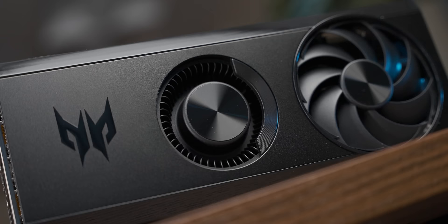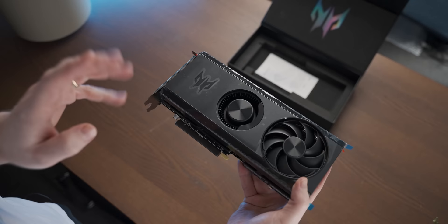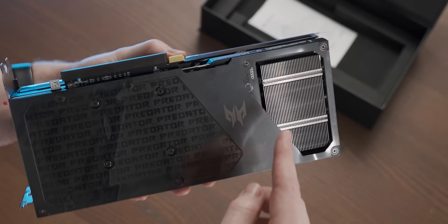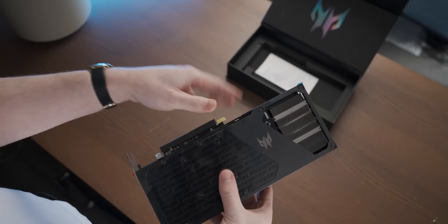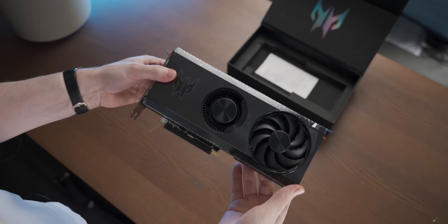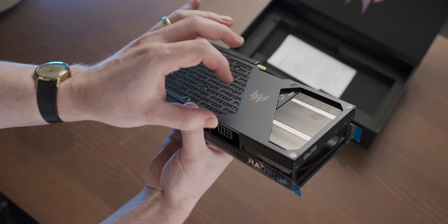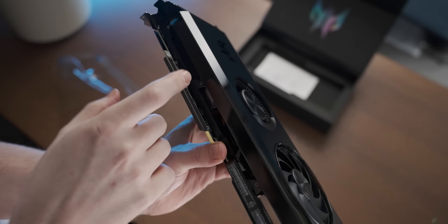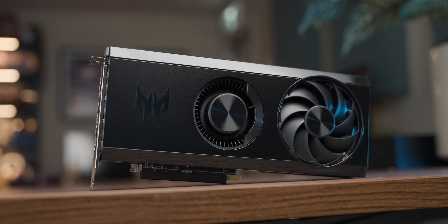And then down here we've got our blower fan, which I'm guessing is here for the sole purpose of adding that distinct howl. The reason I don't think this is a particularly good idea is that because of the axial design, the open air shroud, and what's going on on the back, you're still going to be dumping a bunch of heat into your case — you just also have a loud blower fan on here. But I'm sure the engineers at Acer are way smarter than I am, so maybe this works out. There's a metal backplate with Predator branding on the back, and there's frosted plastic on the cooler shroud which I quite like. Generally, I think this is a pretty cool looking graphics card.